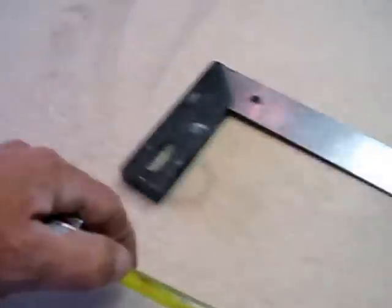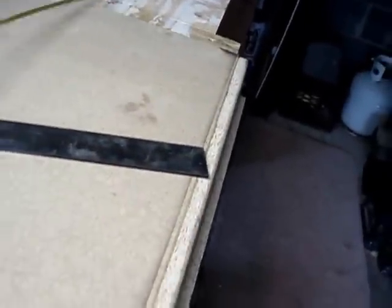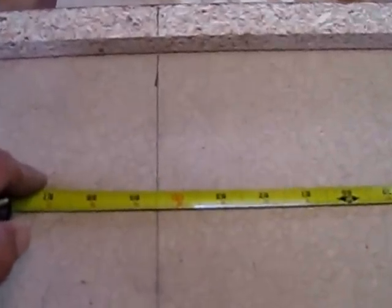Okay, before cutting, you want to get a quick idea what you're making for your length. This particular first length is 64.5 inches, which is what you see on the tape. And the way to get that, a real easy way, is measure end to end, and then again up towards the front. I won't bore you with the details. Okay, that gives you your mark at 64.5.